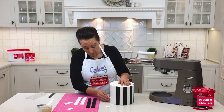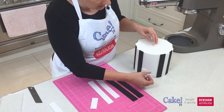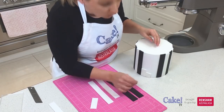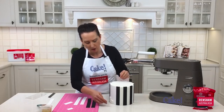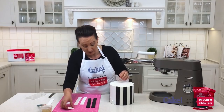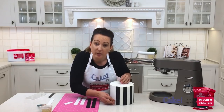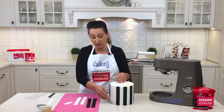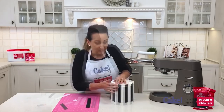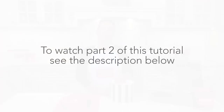What I'm going to do is take some of my off cuts and put them along the bottom just to see how I'm going with my stripes. If I need to change the width of any of the stripes it's a good time to do it now so it's not obvious that you've got some thicker ones and some smaller ones. I can see there's a tiny little bit of a gap that's different, so I'm going to roll one of my last white stripes out a little bit wider. And that was my final stripe — as you can see it's fit in perfectly.